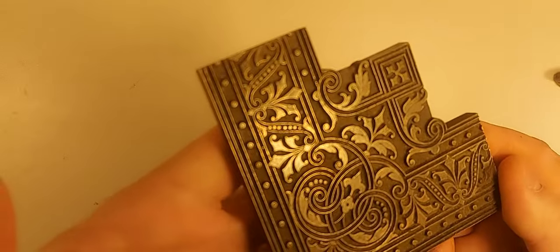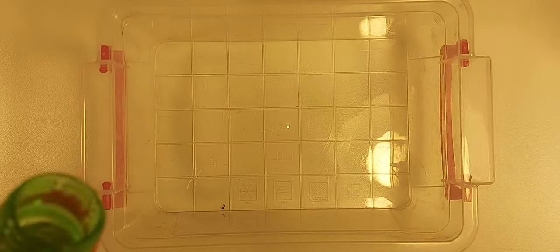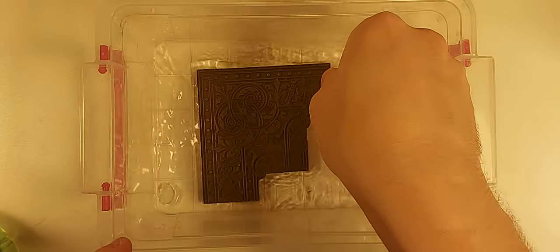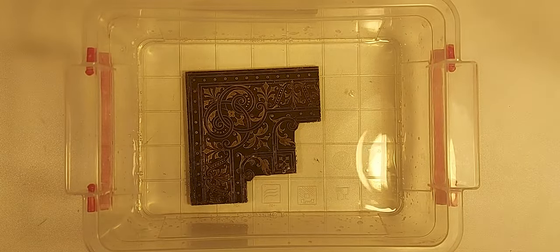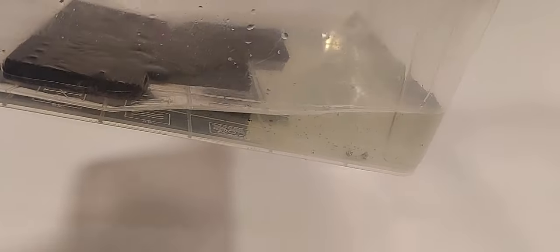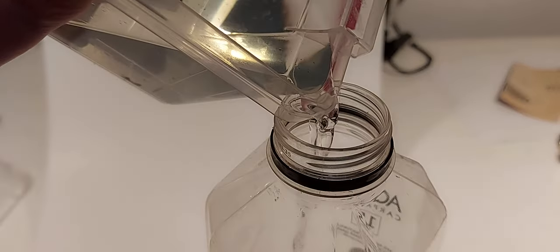As I said in the beginning, there will be two methods explored. So this is the household method, detailed on another die. I took a cheap plastic container and placed a good amount of white vinegar in it, then placed the die face up and completed with white vinegar until the piece was completely submerged. Because the sunken parts were particularly dirty and full of gunk, I left it to soak for 24 hours. After returning to it, you can already see the bluish tint to the vinegar, because the copper oxide on the face of the die reacted to the vinegar, forming a well-known blue compound called copper acetate. After draining the stinky bluish vinegar into a bottle to dispose of later...